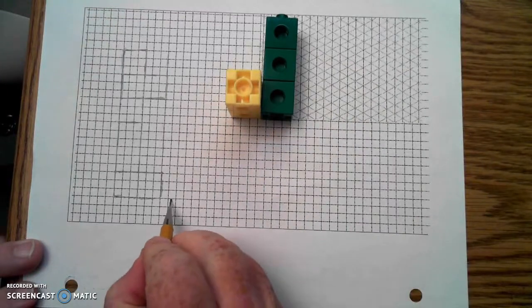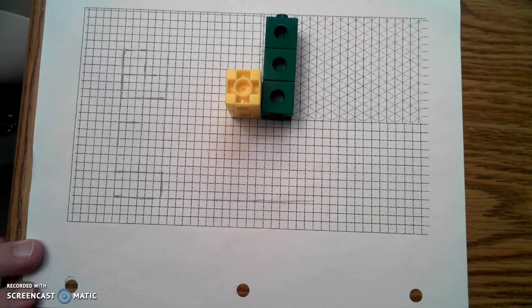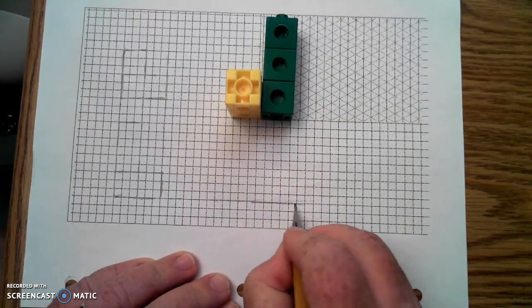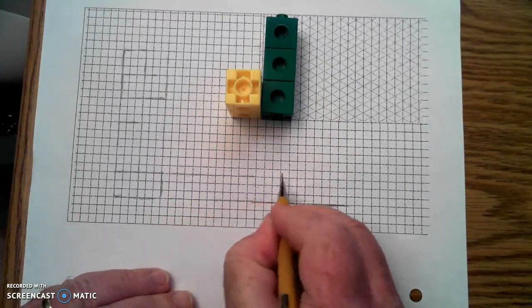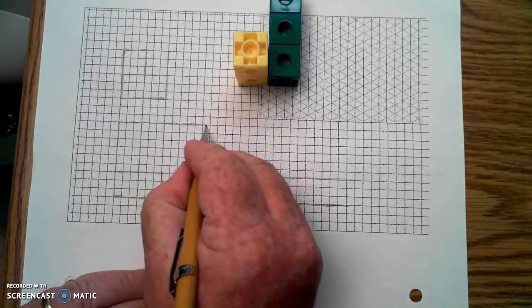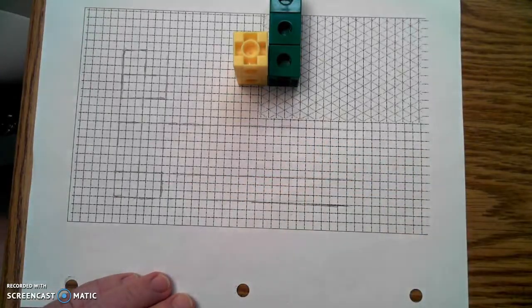So if I move to the right side view, now let's project across from the front. Everything works from the front view. Front view is always most important. It needs to be constructed first, and then all the other views are constructed based on their relationship to the front view. Projection lines should be very light. And those are going across there, and it's way too dark. But I did that way so you can see it.